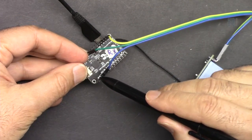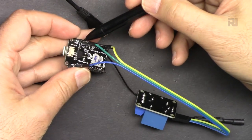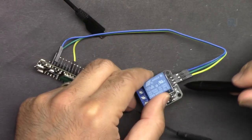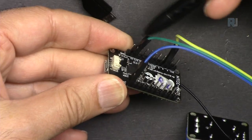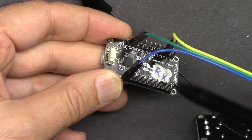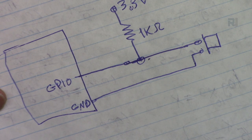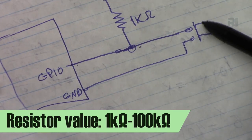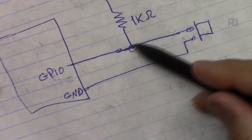The two wires from the bulb are connected to the first and second pin of the relay. This relay has three pins: the right side is negative (ground), the middle is positive (5V), and the left one is signal. I have a separate video explaining that with a demonstration - I'll provide the link below. The negative wire goes to the ground pin, the green wire (5V) goes to the second pin, and the signal pin is connected to GPIO pin 5. Here is a quick diagram: the CubeCell GPIO pin 2 is connected through a 1-kilohm resistor to 3.3V, and the push button is connected between GPIO pin 2 and ground.